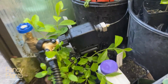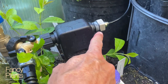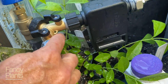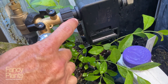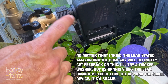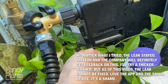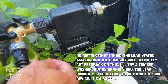The washers made all the difference. This one now doesn't leak at all, and this one leaks just a tiny bit. I'm going to take it off, reapply tape, and then with the washer and the tape hopefully that will stop that leak too. I can't believe that one stopped totally — and now this one is going well.